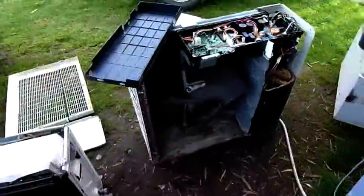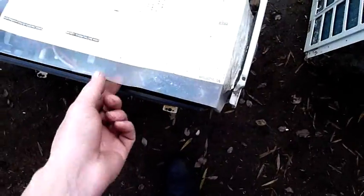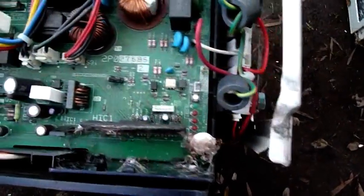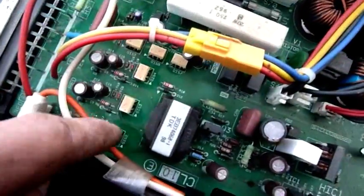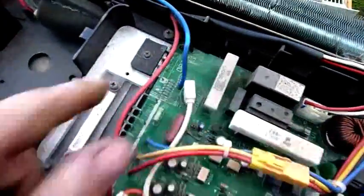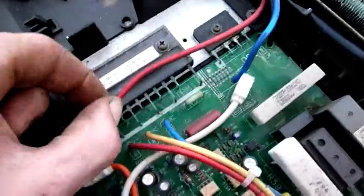Okay, I've got the covers off both of them and you can immediately see there's a lot of electronics in them, and they're not very well protected. This is the worst one — it's got this plastic sheet over the top which is all warped from heat and other anomalies. These ones have been out of service for about 12 months so they're pretty safe to touch, but if you've just been powering one up, discharge these capacitors or it will kill you. First thing I can see is a lot of spider material — there's an egg sack and a lot of dead baby spiders, with spider poop burning through the traces. There's a lot of green oxide on the pins of the terminals, all these ICs. This board has seen a lot of moisture, a lot of mould growing on top of the relays, green oxide on the rectifier and on what I think is an IGBT pack.